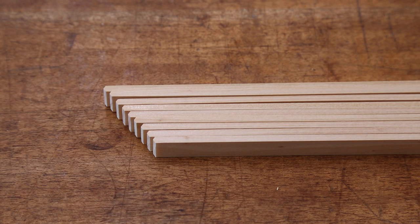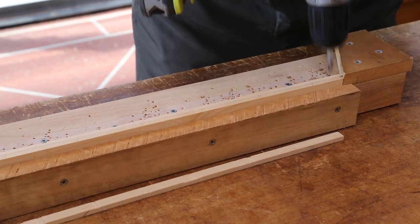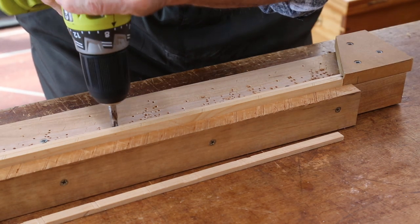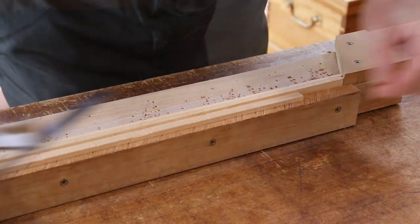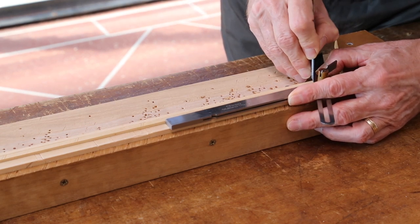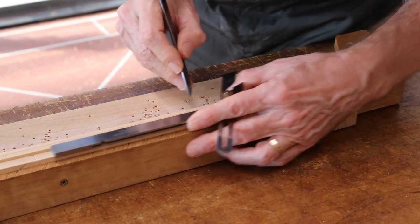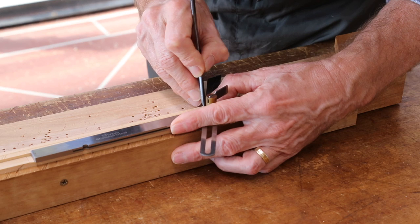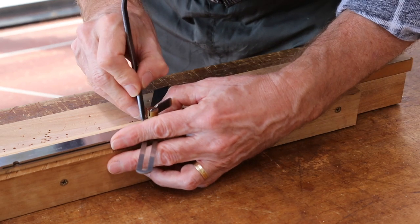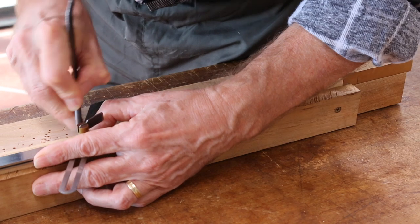Next, trim the ends of 9 Kumiko to a point on the 60 degree jig. This gives the Kumiko a flat face against the end stops. Place the master Kumiko next to the story stick and secure them in the jig with ends firmly up against the end stop. The A Kumiko have 7 joints, whereas the B Kumiko only have 4, so we'll mark these separately. The group of 9 Kumiko gives you a fairly wide area to cut, so if you feel that 9 are too many to cut at the one time, mark up 2 master A Kumiko and cut the A Kumiko in one group of 5, then another group of 4. This is how I have students on my intermediate workshops cut the A Kumiko.